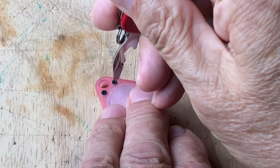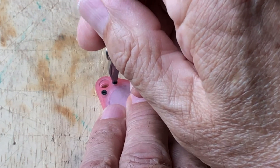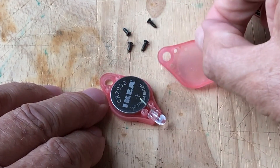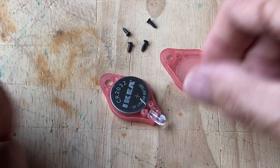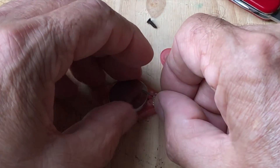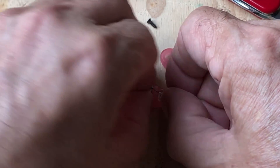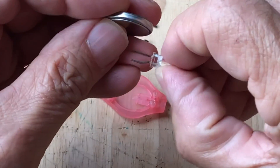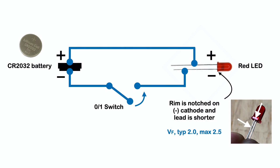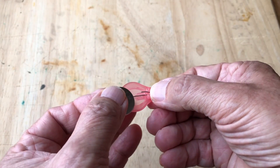There are typically four tiny Phillips screws that hold these lights together. Removing these screws opens the case and reveals the batteries and LED. This light is a simple circuit made up of a red LED, a momentary switch, and a 3 volt CR2032 battery. Some LEDs — red and yellow for example — run on lower voltages and work with a single button cell. When reassembling the light, remember to match the polarity of the battery to that of the LED.